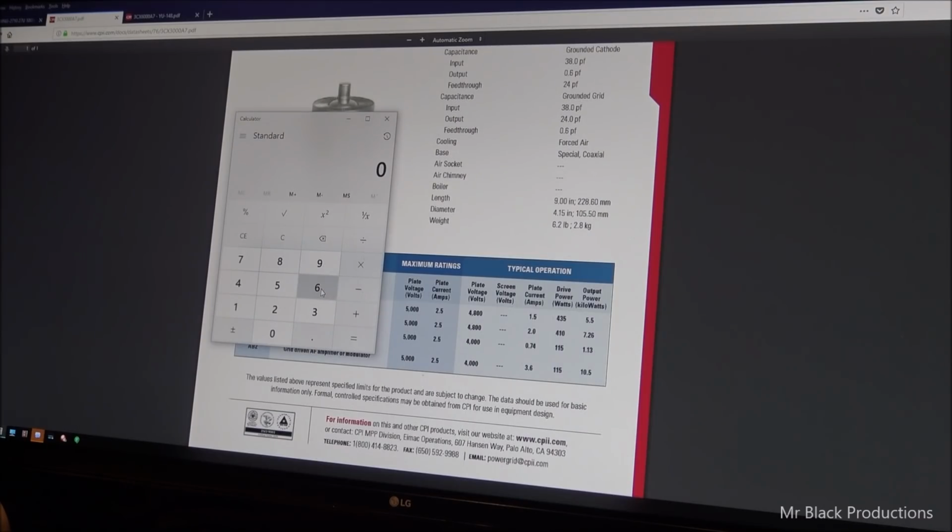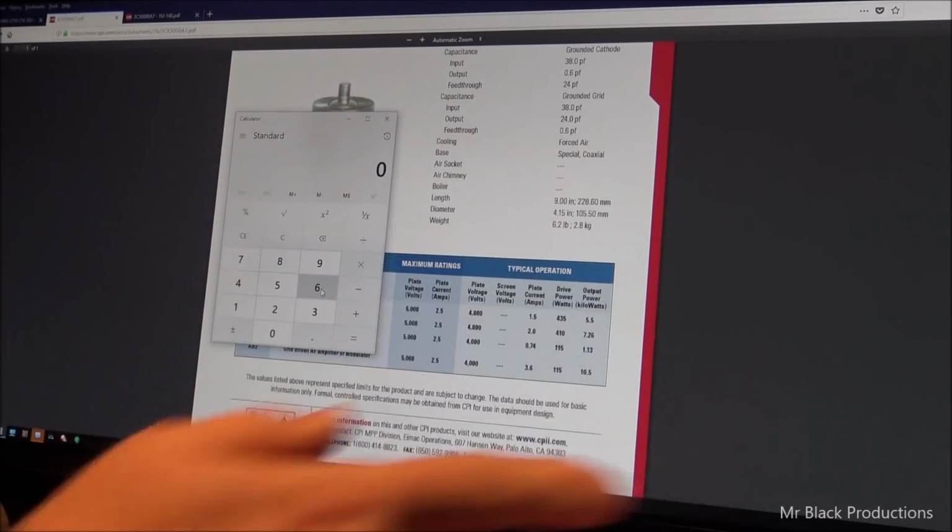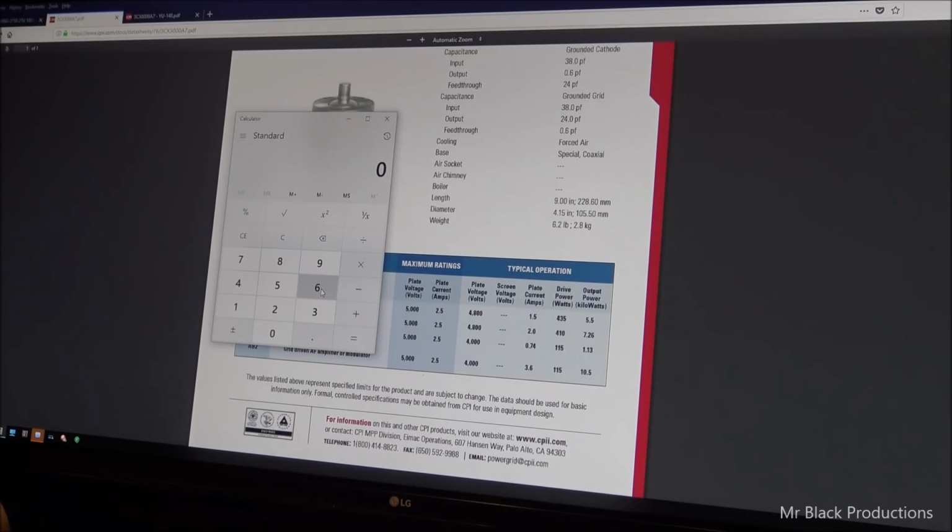The problem is their one transformer that they rated at 100 amps produced 3.5 times the amount of current that the transformer it was paired with, and I ended up taking the other transformer out and setting it aside for parts and sending this amp back with just one transformer in it instead of having to have two. That's because his modeling program called for a much larger secondary that had more surface area, and he used thick copper flat strap instead of a wire mag-coated thing. What I'm getting at is the transformer outperformed everything that had come before it.